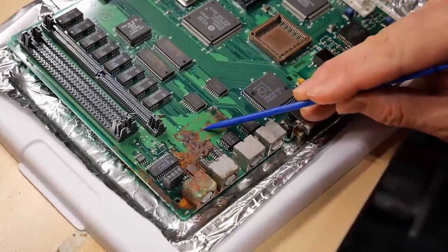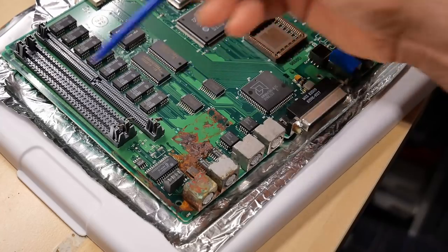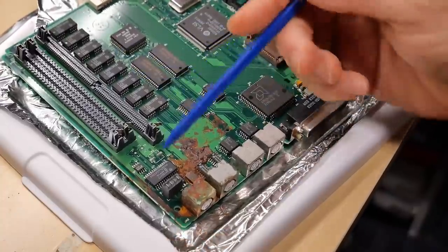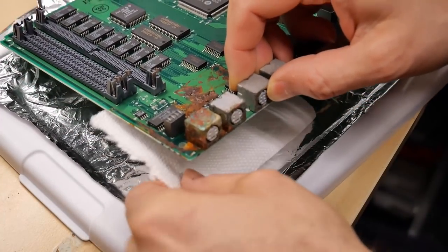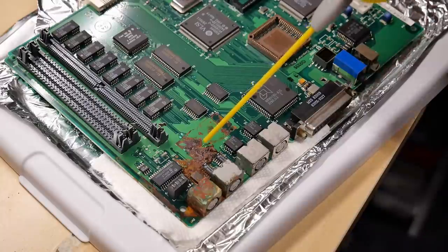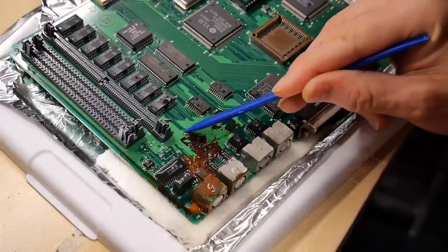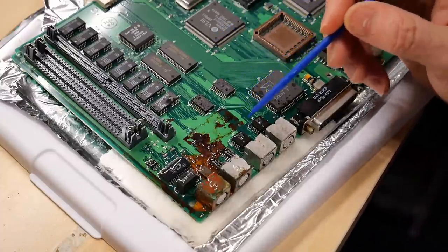Post-cleaning — definitely some of this crap came off with the cleaning. I see it's actually coming off if I poke at it a little bit. But I think it's now time to hit it with the WD-40. I don't have a tub big enough to hold the motherboard, so I set it on the lid of a tub and put some aluminum foil down just to capture the WD-40, because I kind of want to soak it in a little bit. On the underside of the board there's also some corrosion that definitely needs some WD-40 action. I'm going to put a paper towel there just so it helps soak up the WD-40 and it sits up against the motherboard. WD-40 — it's going to soak all of this area. This reaction is pretty slow, so this is the long game — definitely not fast. And I'm just going to be soaking this, I'm sure, for days and days and days.